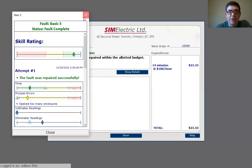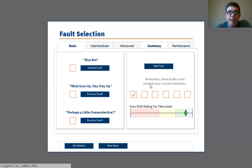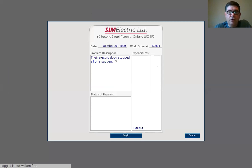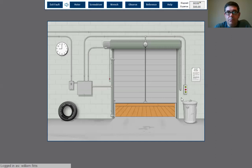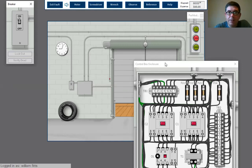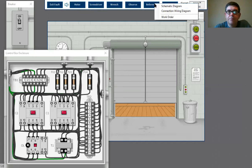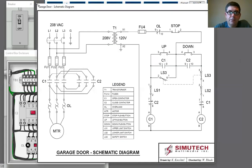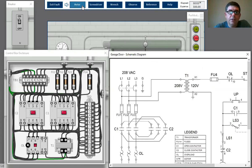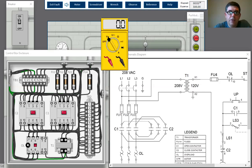Now let's go to intermediate. Their electric door stopped all of a sudden. Up — nothing. Down — nothing. Let's take a look at our disconnect, make sure we're still on — yep. Let's get our schematic out so we can go through the testing points. Get the meter. It all of a sudden quit, so let's check power.